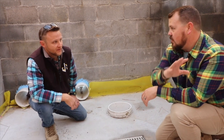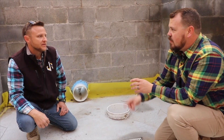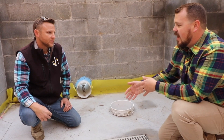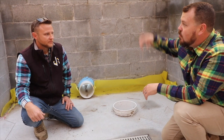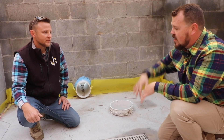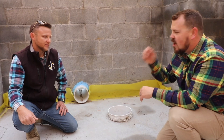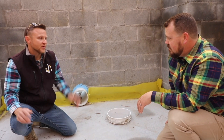The interesting thing is: once the house is built, if there's a water line break at the other end of the house — more than 100 feet away — that water can drain here because of the slope. But what's really awesome is what this drain has done during construction. Instead of having sump pumps running every day pumping water out while the crawl space is open to air, water just drains here naturally. It keeps the crawl space dry, not musty and not covered in mud — great planning.